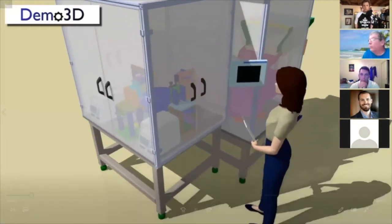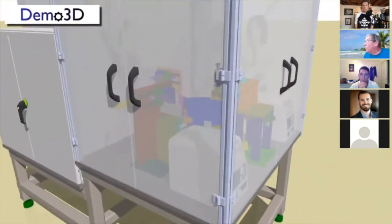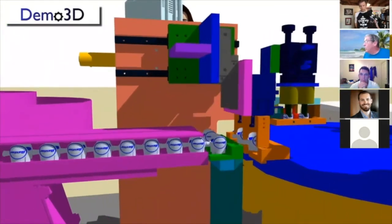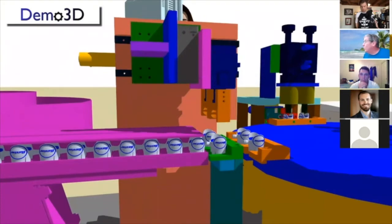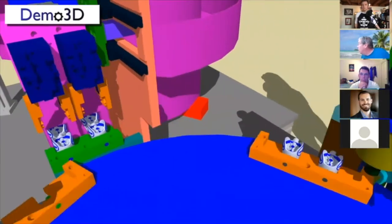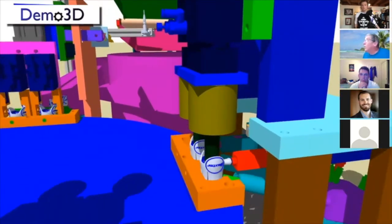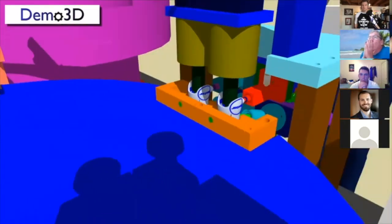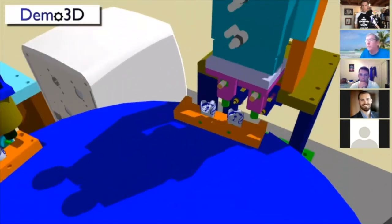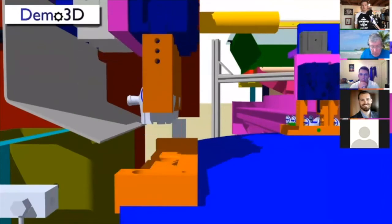So it is going to be variable. Yes, those are accurate. I'm sure there are cases where people have less depending on what they're doing. We also, however, have people who will be using one thing, for example, a commissioning project, but they will also come upon things they didn't realize. We had a really interesting experience in our user group meeting last year where somebody came to present on commissioning. It was a bus body paint line, so they're actually painting, like Bluebird buses, the big bodies. The job was to commission, but once they got the layout from the system designer and were going to start working on commissioning, they first created the system, made sure the flow was right, and they found out that the design was bad. They had put the end of the paint booth too close to an external wall, and so they had to turn the power and free system pretty tightly.